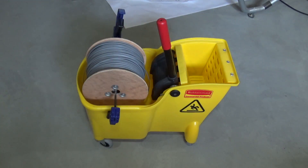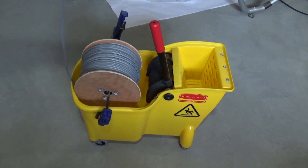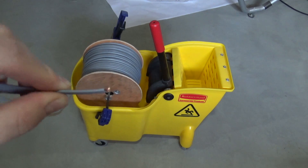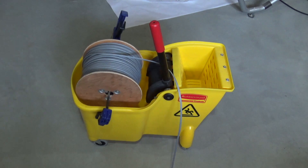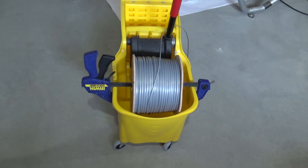The first thing you need is some LocoNet data cable. I recommend the flat variety over the round because it's way easier to put connectors on, and it has the same colored wires as the Digitrax stuff. I bought it in bulk, and for long runs I find it helpful to keep it in a mop bucket with an Irwin clamp through it so you can move it wherever you need and do your wire pulls easily.